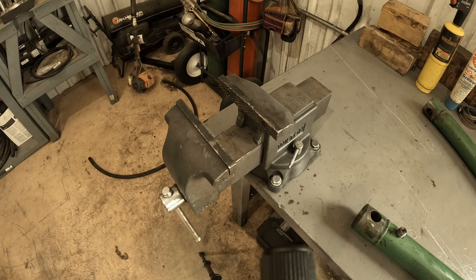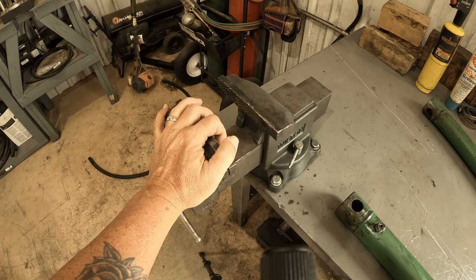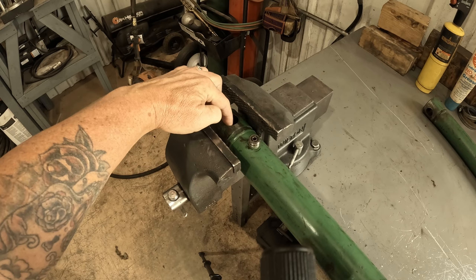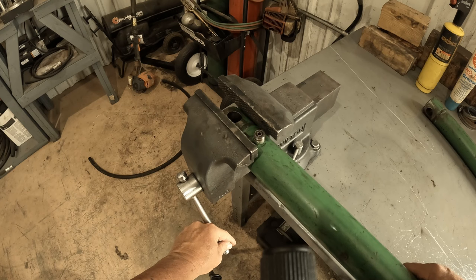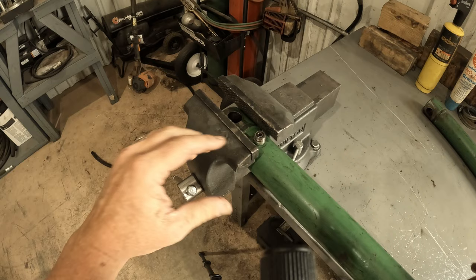I'm going to get these things clamped in the vise. My vise has these little inside jaws for clamping on pipe as well as the upper jaws for flat stuff. When you go to clamp these things down - two things: one, don't smash the fitting, and two, don't clamp it up here on the barrel. It's thinner walled. Down here where it mounts to the loader, it's got some meat and heft to it and you're not going to crush it. When you do it on the main barrel, you run the risk of crushing it and not being able to get the piston back in because you've smashed the tube. So it's better to clamp on this end and not on the actual barrel itself.